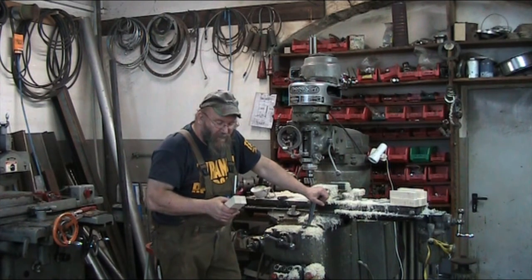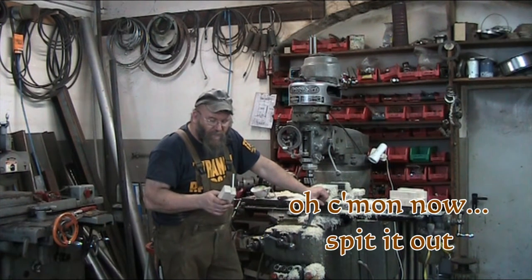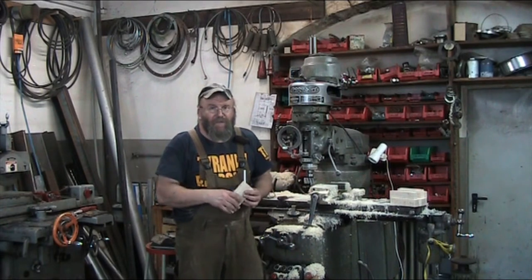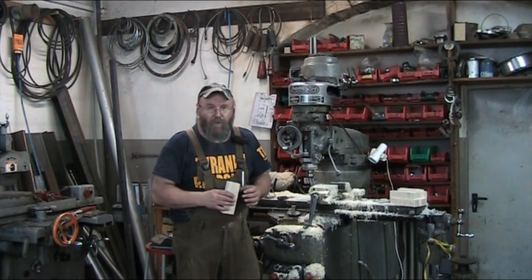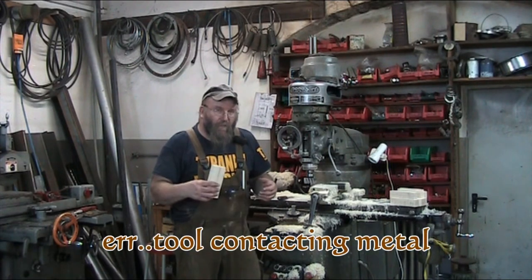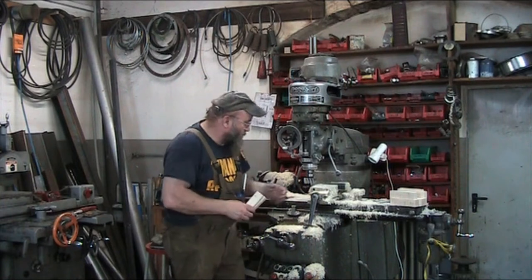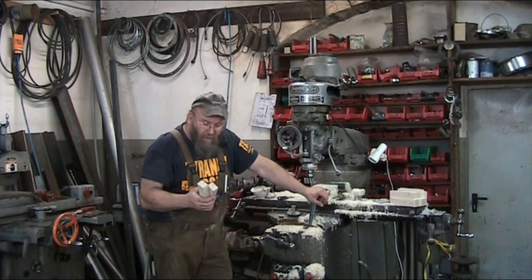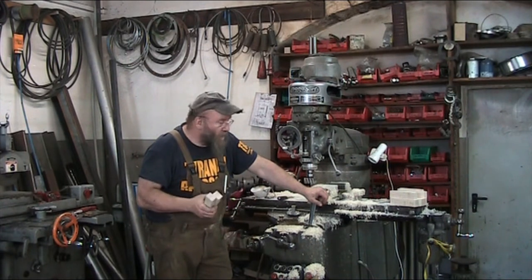Well, once in a while you get a challenge of sorts. I don't know quite how to phrase this, but certain woodworking machines oftentimes have parts made of wood or plastic in places where contact with the tooling would pose a danger, so those contact areas are supplemented with wood or plastics. Well, in this case today, in this Marinus double end matcher, the blocks are going to be out of wood. We've had them out of plastic before, but we started making them out of wood ourselves.